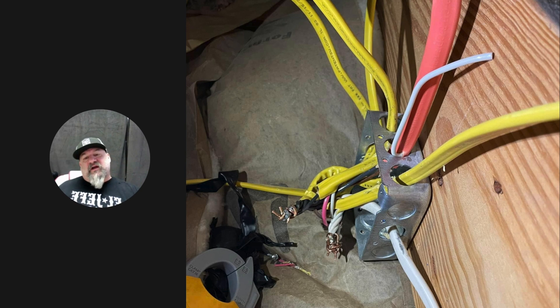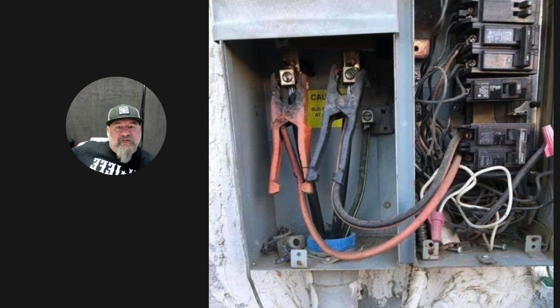That's a nice code violation you got there, Uncle Johnny. Now answer me this: are the jumper cables powering the panel, or is the panel powering the jumper cables? Looks like it used to be a meter can — they pulled it out because they got tired of them rigging it to get free electricity. That looks like the line side. There are jumper cables — it's 240 volt — and I don't see a neutral, so they're probably using the ground as a neutral. Since the grounds are tied in with the neutrals at the service end, all those grounds are now energized when you have a load on there.